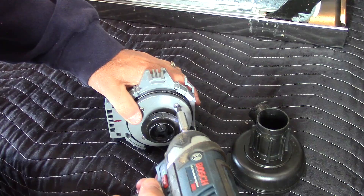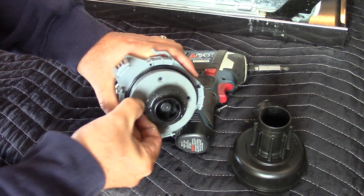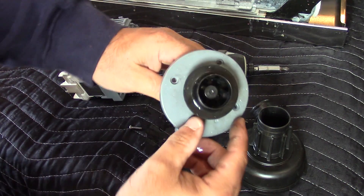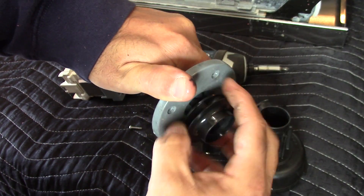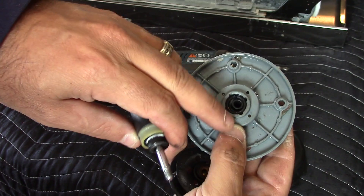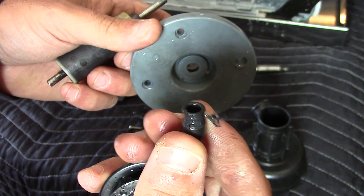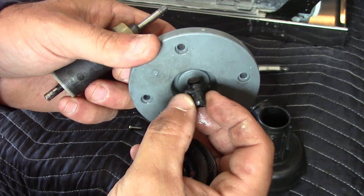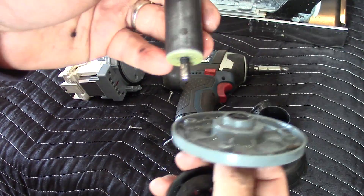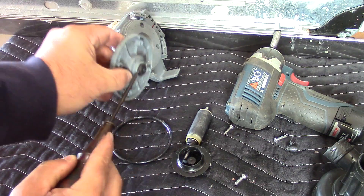There are four screws. Here's our rotor — this here is your impeller, and it screws off like this. In here there are carbon bearings. What I did is I put a little piece of plastic in here — you can see it's worn down — just to try and run the dishwasher through a cycle to make sure that was the only problem, since I got the thing for free and don't really know the history on it. This is what the bearings look like; the armature actually runs through the bearing.